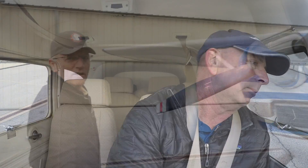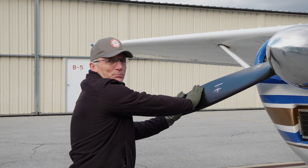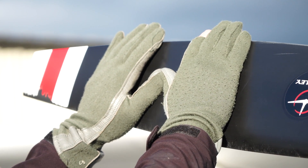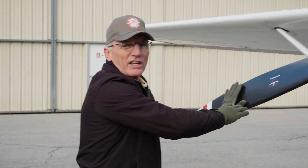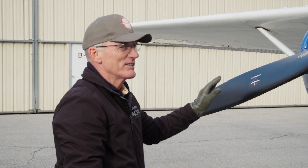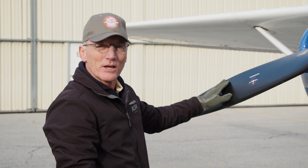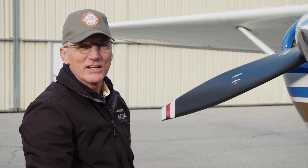Okay, contact — it's hot. To prop the airplane, you want your hands on the outside of the prop as much as you can. Don't wrap fingers around the back of the blade. It's a good idea to have gloves because rings or anything on your finger can get hung on the prop, and you don't want that to happen. It doesn't take a big hefty push — it doesn't take much in these airplanes. You're really just looking for the prop to swing and for that magneto to click.